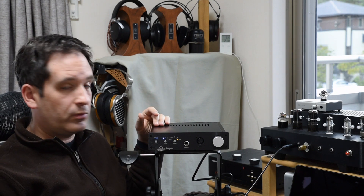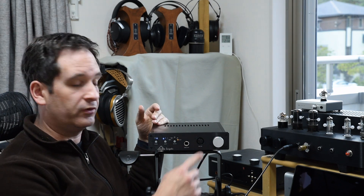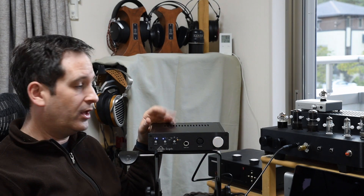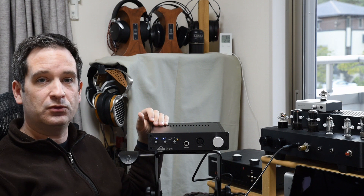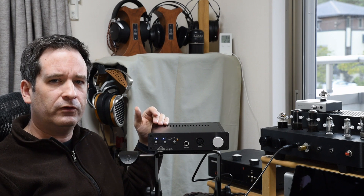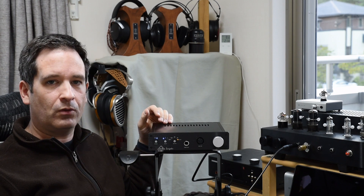Really that's all there is to it, and it works the same whether you use the unbalanced or balanced output. There's no gain or benefit from the balanced output here because the actual amp circuit is single-ended — it's not a fully differential, fully balanced design. It worked fine whichever one I used. As typical of Pete Millett's designs, the sound has a bit of sweetness and tube warmth to it. The only problem is that if you tap the chassis with headphones in, you get a pinging sound, so the way he's mounted the tubes isn't quite ideal in that regard.